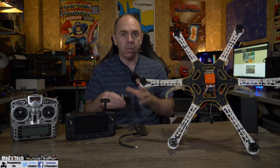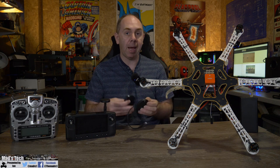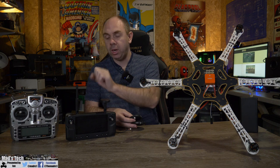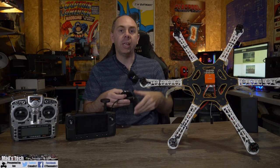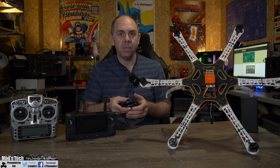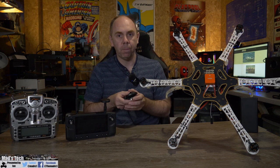We're going to take a deep dive into the new options around using multiple CAN-based GPS as well as CAN-based compasses. We're going to look at radio systems, setting up with Herelink as well as traditional radios such as the Taranis. We'll look at external sensors such as setting up the external baro sensor on the Here2, and at the end of this series we're going to take a little dive into the new Lua scripting features that have been added to ArduPilot.